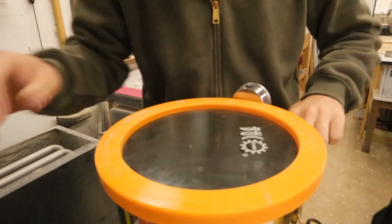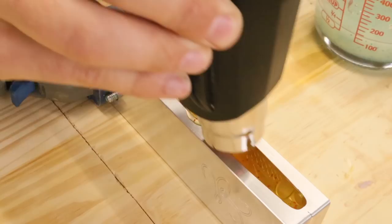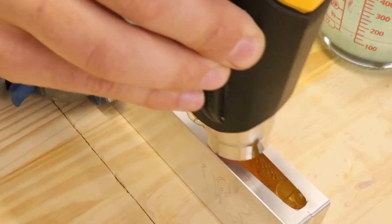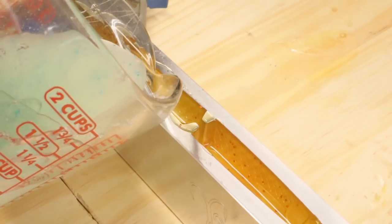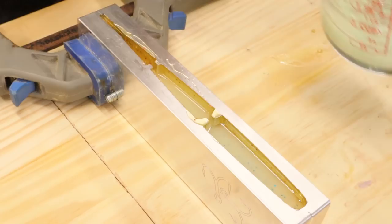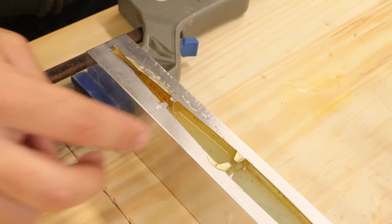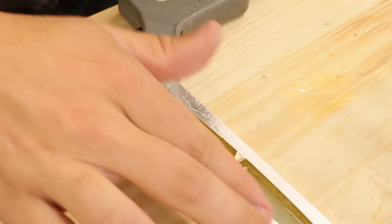The plastic is still well above 350 so it's safe to vacuum still. You have to heat an aluminum mold more than a silicone mold — that aluminum sucks the heat right out of the plastic, so this requires a lot of heat; you're going to be blowing smoke everywhere. One thing about this mold though is that those segments separate things, and it's kind of cool — I did not get any of that white in the tail back here, you can see it's still orange. I got all of it just up in the first two segments, but then we're going to transition to this color and that tail piece is going to be darker than the front body.